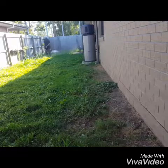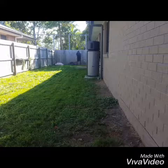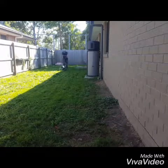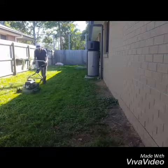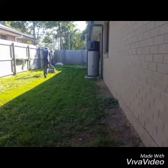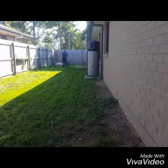You see the moisture coming up, and so then you'll go through the mower maybe on the highest setting or a couple below the highest. If you can't cut it down enough with the brush cutter, you might need to do a half pass or whatever, but you're going to aim to take a third of the height off of it in this first few passes here.